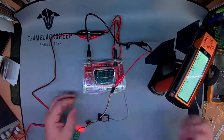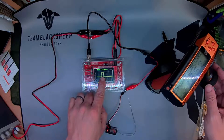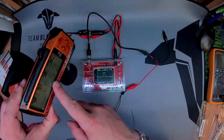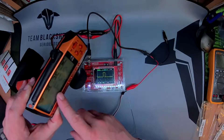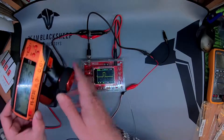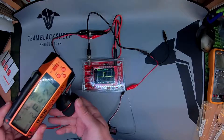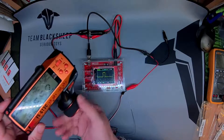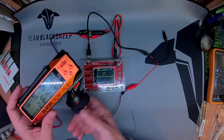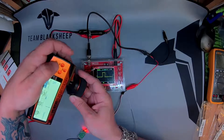I've got this bound up and we're getting a signal — there we go, we have the perfect signal. That looks to be about one and a half milliseconds in center, which is correct — 1500 microseconds. Generally you have 1000 on the low end and 2000 on the high end. Turning left should shrink to one segment — we're there or thereabouts. Full left and taking it to 100% — look at that, exactly what we need.